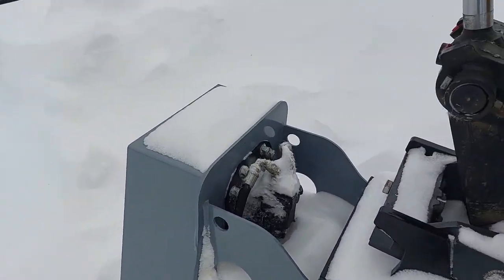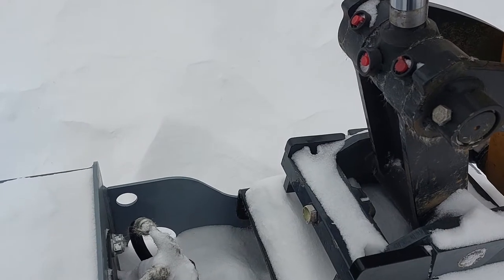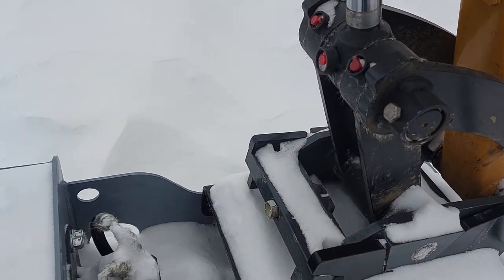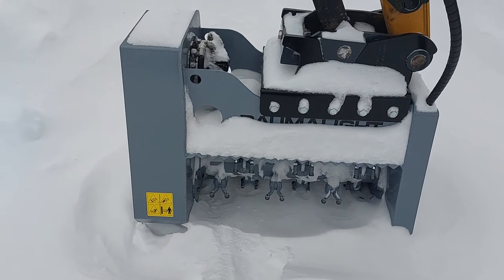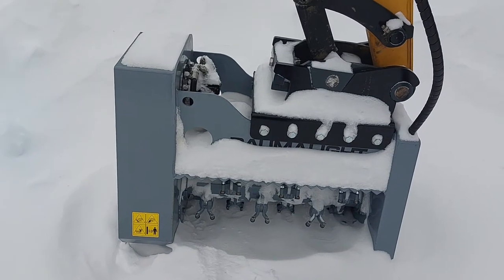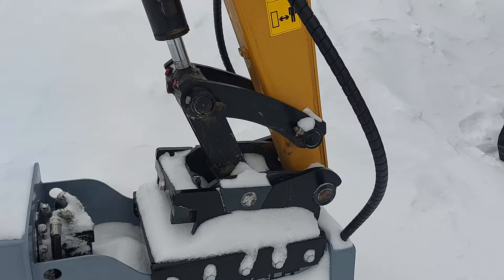I've got an AMI quick attach — it's a typical Western Canadian mechanical quick attach. You pull the bolt out like on the bigger machines, and they always come loose unless you do them up with an impact. The bigger machines will have two; this just has one, plus a little clip that goes in the back. The mulcher is made for two to four inch brush, uses a stump-grinder-type carbide tooth. They've got cup shapes so after one part wears down you loosen the nut, turn it to a fresh part — you get about three turns out of each, or so they claim. Wait till you hit a piece of rock.